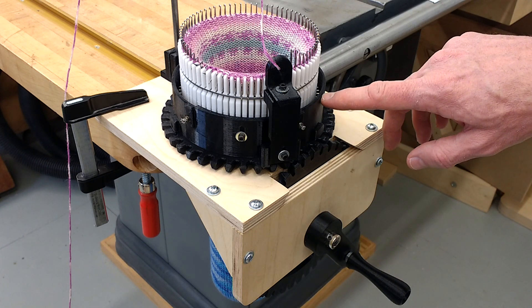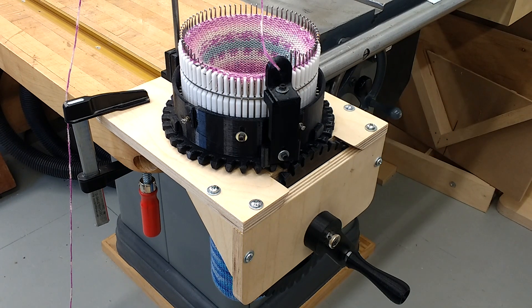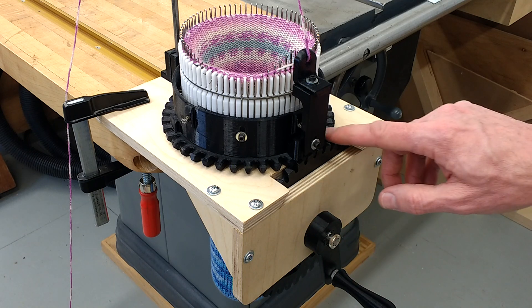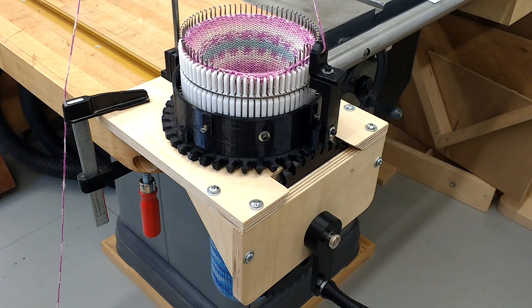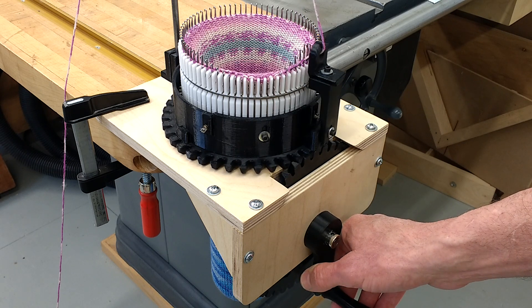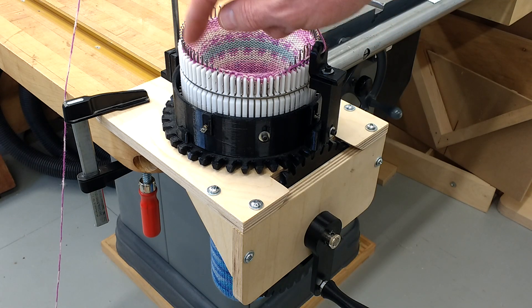This is the cam shell — this is where the work happens. It's named for its internal ramps or cams that use the foot on the needle to bring that needle up or pull it down. You'll see it has these ears on the side, just like the metal machines — when the gear ring comes around, it hits that ear and that's what turns the cam shell. It can also go in reverse, which you'll use whenever you're doing heels and such. In reverse, you'll want the guide on the carrier to be close to where the needles are high, which will be on the opposite side.